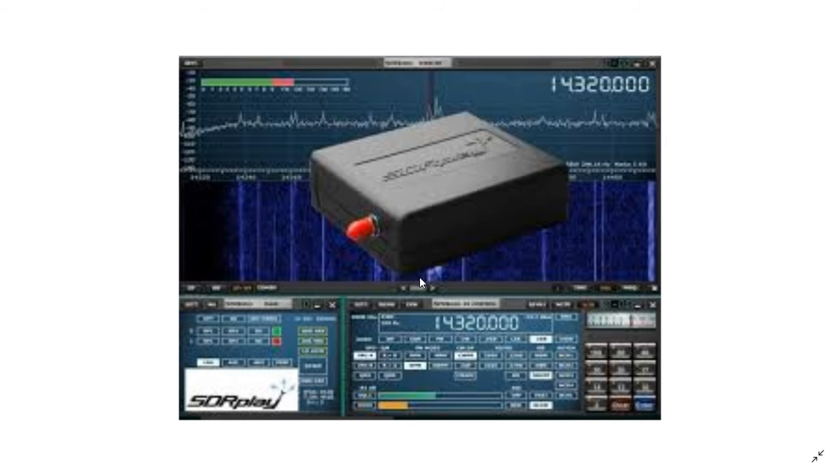The longwave band seems to be good, but unfortunately I have high interference and lack any weak signals that I could use to really test it out, so I can't say much about longwave performance. It goes from 1 kHz way down in the longwave spectrum all the way to 30 MHz. This is a wideband receiver, so it goes up to 2 GHz. But if you want to hear what I think about the above 30 MHz range, go to my VHF/UHF channel, because that's where I'm going to talk about that part of this SDR.